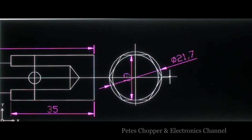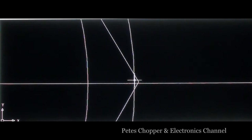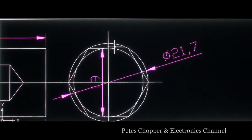The nut size at the top, this is for tightening the drawbar. It only needs a nip. The outer diameter, I've already machined, I will machine to 21.7. Once I mill the flats, you can see that the outside will just clip the flats. The size of the head is the same size as the Imperial head on my other drawbar, so I can use the same spanner on each. So it'll be metric at the far end, going into the R8 adapter, but the nut on top to tighten the drawbar up will be exactly the old Imperial size.